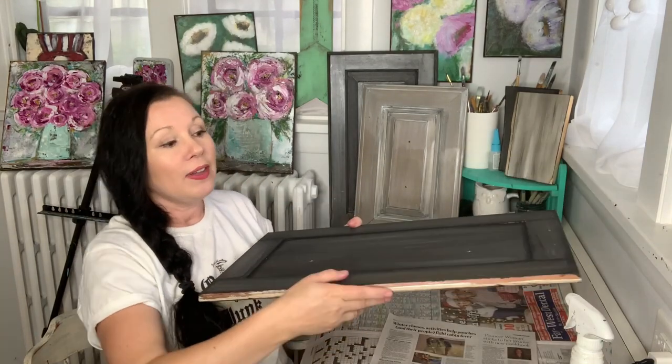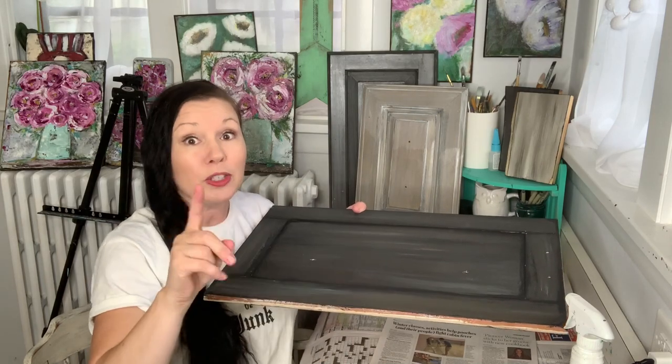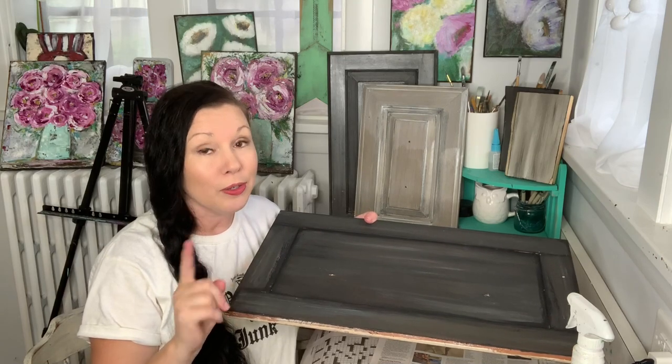One thing I found when you disassemble your kitchen cabinet doors off of the frames — the boxes that the swing-open doors are attached to with hinges — is that your kitchen cabinet doors are creatures of habit, much like ourselves. The screws want to go back into the same place. So when you take your kitchen cabinet doors off, make sure you take a little Ziploc bag, throw all the screws, hinges, and the hardware from the front of the cabinet door into the bag, throw it into that cabinet itself, and take a little piece of painter's tape — write number one on it, put it on the baggie, put number one in the box, and also put number one on the cabinet door. Take a picture of your kitchen in place before you disassemble it, because you're going to need that to look back on.